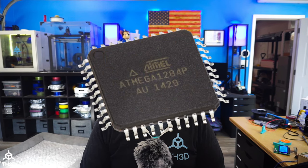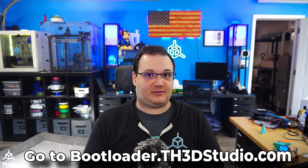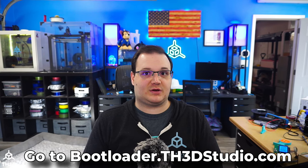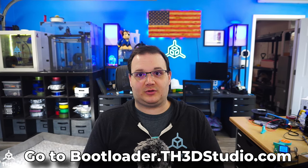With certain 8-bit boards, you have to install what's called a bootloader on the printer. This is typically limited to printers with what are called the 1284p CPUs. If you have a printer with that processor, we have a different video on our channel as well as a software package to download that you can flash the bootloader with. We also sell a bootloader kit in our store called the UNO bootloader kit, linked in the video description, that you can use to install a bootloader on your 8-bit board if it doesn't have one.